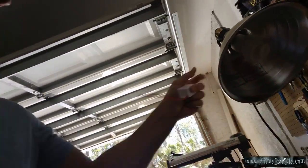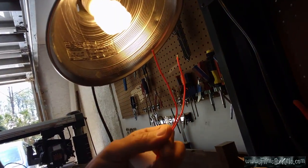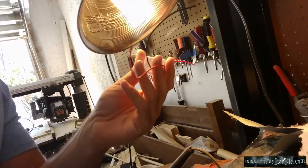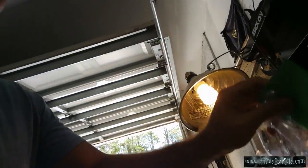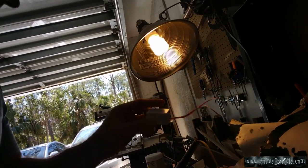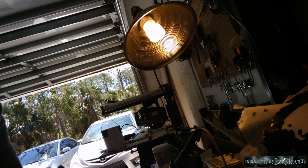Here it is right here. What this does is take that high voltage and convert it down to five volts. This was a couple of dollars. I hope it works and doesn't burn down my house. What I need to do is solder this to the ESP8266, then connect the other side to the high voltage.